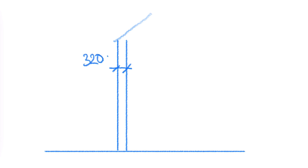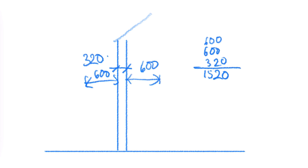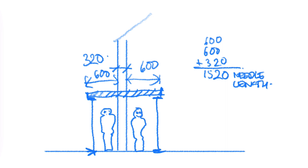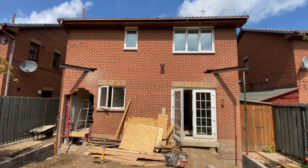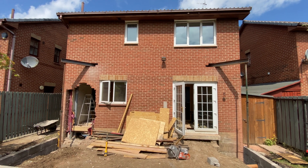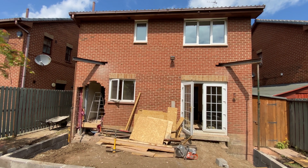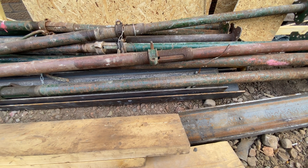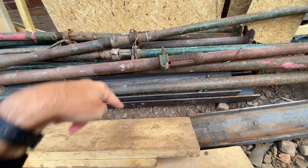The needle length is set by the thickness of the wall you're demolishing plus a space either side for a person to physically get the beam in. Usually five to six hundred millimetres each side will do it — in this case I'm going for 1500 millimetre long needles, plus some longer ones for the two end needles due to the arrangement at the gables. I'll need two props for each needle, so for this we need 14 acro props in total, which you can rent from your local hire merchants.